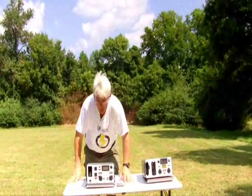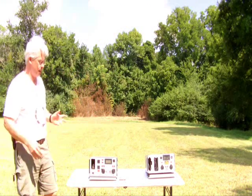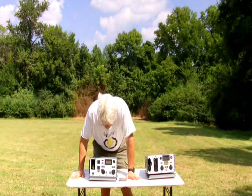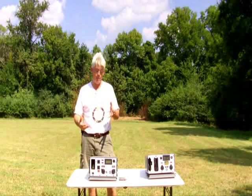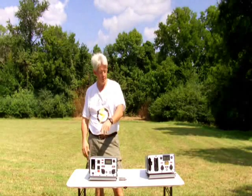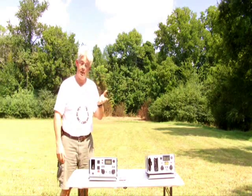Because we're able to put more info right here on the faceplate, we can put it in front of you. So if you're stressed out, tired, confused, the lights are out, or you just don't have time to pull out a laminated quick reference card, you can find what you need right there. So to cover specs: you've got a 40 amp-hour battery bank, 10-amp charger, 10-amp solar controller, worldwide voltage, the upgraded USB, the 450-watt inverter. There's no solar panel. It's the same size. Even though you've got all this added capability, these two machines weigh the same within a few ounces of each other — about 29 to 30 pounds. Depending on your pocketbook and your needs, this might be the ticket — maybe it means you don't have to buy a Mark 1 plus a Juice Brick, and if that's the case, you only have one thing to worry about.